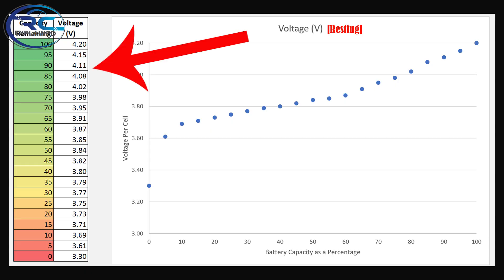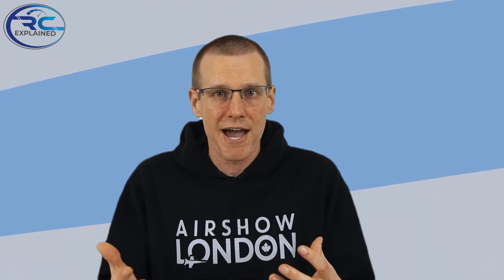If we reduce the charge to 4.10 volts and look at the chart to see what capacity or state of charge the battery will be at, this is essentially what we're giving up — more capacity within the battery pack, meaning we won't get as much runtime. The second thing we forfeit is performance above 4.10 to 4.20 volts per cell. That performance comes in the form of driving the motor to higher RPMs, which gives you higher potential top speeds.